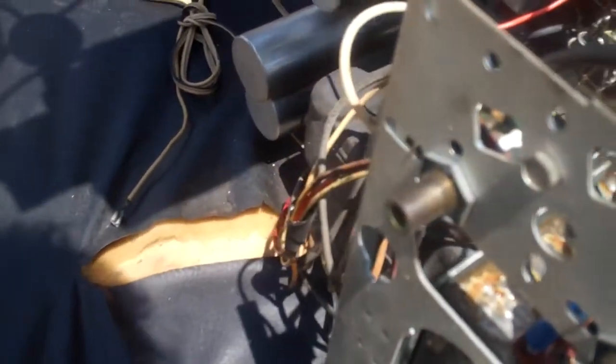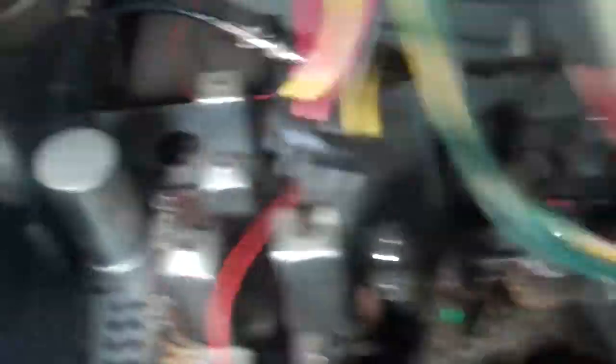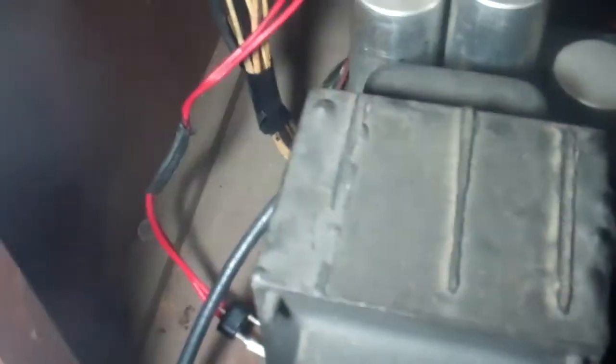I bypassed it because they use the circuit breaker anyway. I'm going to stick the shaft back in so the TV looks good cosmetically. If someone pushes it in and pulls it out and it doesn't turn back on, I'd have to come back down here — might as well handle it now. Everything's hooked back up: yoke, CRT, high voltage, video feed, degaussing. Let's give it power and see how we do.